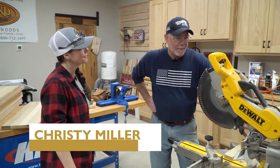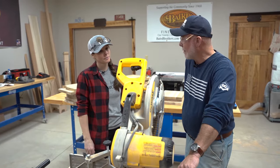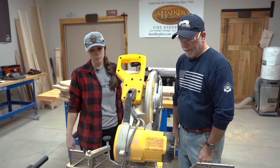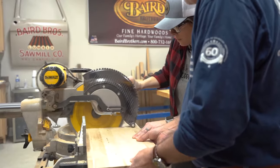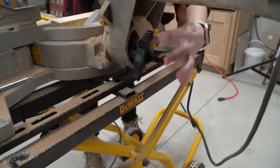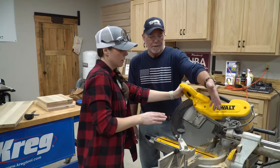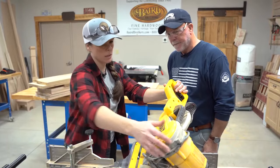Let's talk about this new tool to our shop — the miter box, cross-cut saw, chop saw. People call them chop saws because the main mechanism is chopping down and cutting a board straight across, but you also have the ability to rotate the base for angled cuts — useful for trim or baseboard. You can also tilt it for crown molding, giving you those nice bevel cuts. A few other great uses: making the same cut over and over again using the locking stop, and this model has an 11.5-inch-plus cutting surface with sliding support wings.